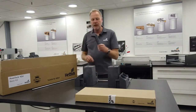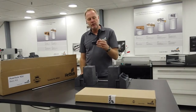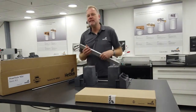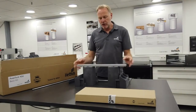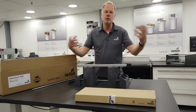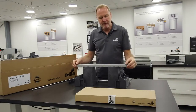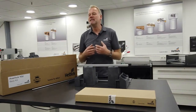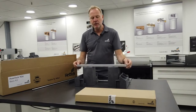We also have the Praktika 275 in our basic kit. This drill jig is made for preparing the wooden back panels. What is new with AvantiQ is we have a direct fixing of the back panel. We are not using the usual steel back panel connectors, which you fix with some screws and then clip on or fix the back panel with screws. Now we are fixing the back panel directly to the AvantiQ. We are doing that because you are saving time — labor costs are very high and with the direct fixing you can save a lot of time.